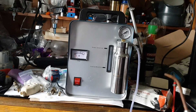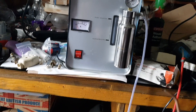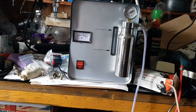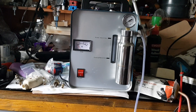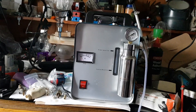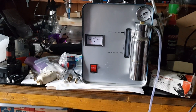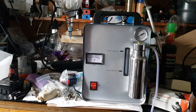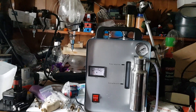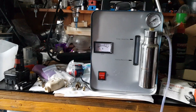The only other thing to watch is the HHO — hydrogen particularly — is lighter than air. So the hydrogen you produce with one of these welders or brazing machines rises, and if you're indoors it rises up to the ceiling where it could theoretically become an explosive risk. So you really want to have a window open and blow the air around from time to time if you're going to do a lot of this indoors.